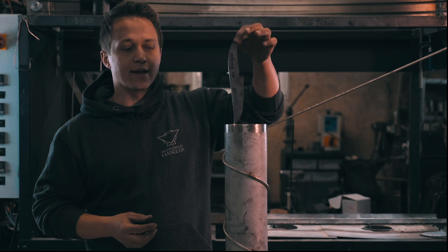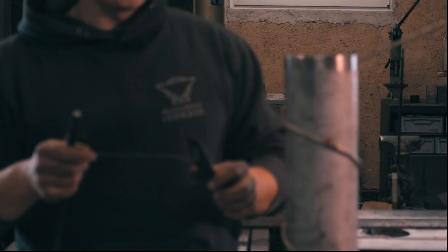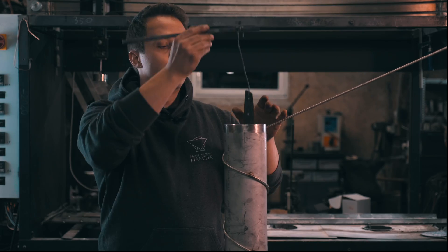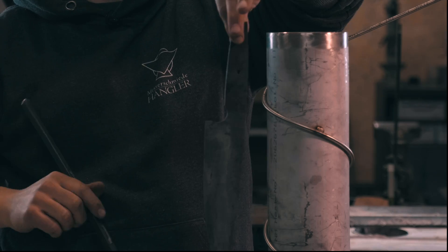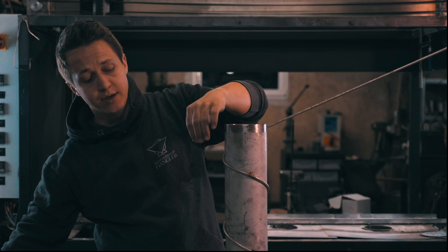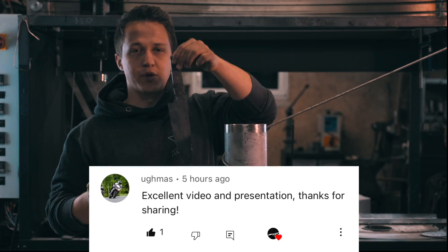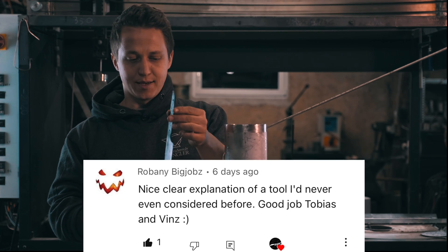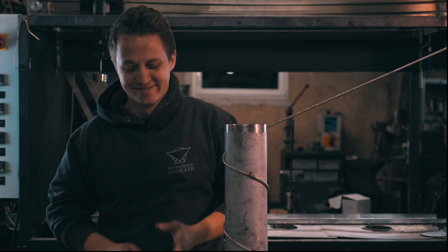You just hang the knife in by any hook that you have, just put it on the side. This will also help a lot with warping and distortion because the knife is now hanging completely free in your kiln — it doesn't warp or bend to any side. It's completely free suspended. So if anything, it gets straighter as it heats up. And that was about it.